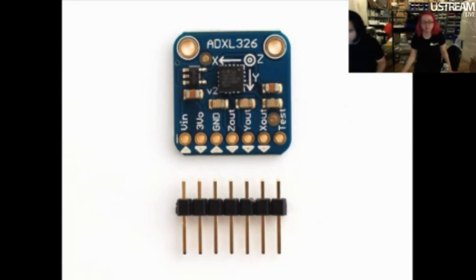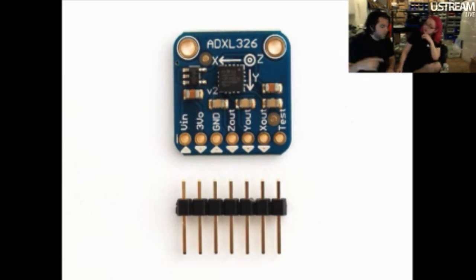This is our star of the product show — our second accelerometer. We already carry the ADXL335, which is a plus or minus 3G accelerometer with analog outputs. We like analog outputs because it's really easy to use — sometimes you can plug it directly into whatever project you want without needing any digital IO. You can connect it to something with built-in ADCs. Someone from Analog told us they also have these in 16G, and it's even pin compatible. So we made basically the same circuit board, changed the silkscreen to reuse the same pick-and-place program and stencil — saved us a couple hundred bucks. This version is plus or minus 16G. 16Gs is a lot — I don't think you'll need more than that for any kind of project. Full triple-axis output, really easy to use, and it's under 20 bucks — $18.